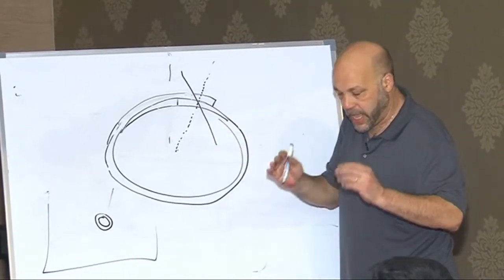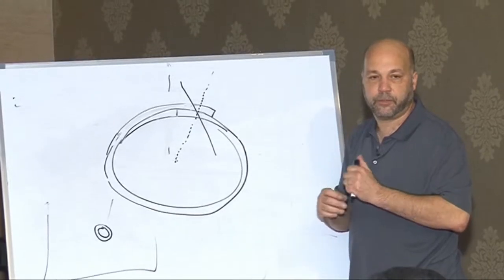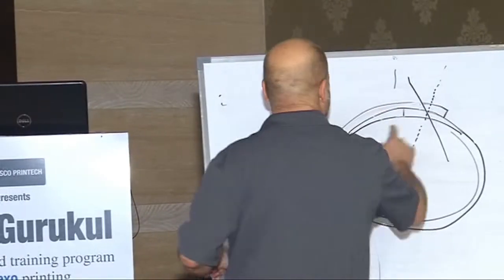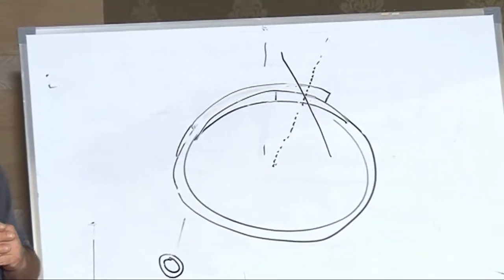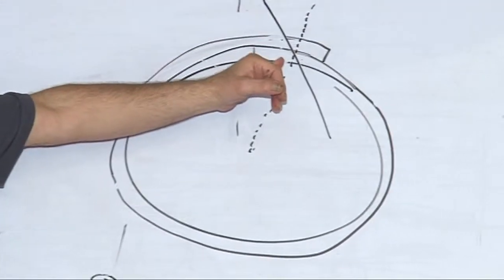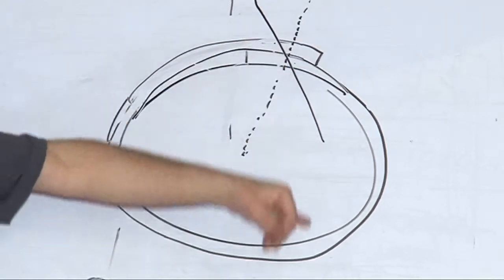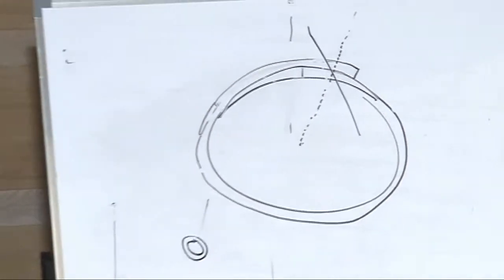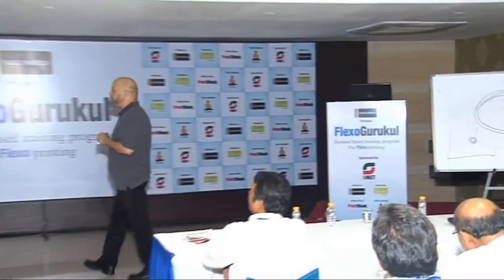With a little bit of practice, you can make a seam that is — sometimes you can't even see it. So if I do that and then overlap it with the plate, usually — unless it's very fine work and I'll take time to do something different — if I do that kind of a splice, that's it. I don't have to worry about it. I can spin that cylinder, put the plate anywhere, and it works. So that's a little free trick.